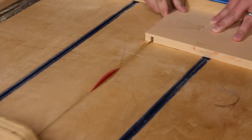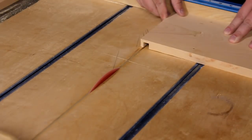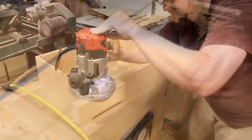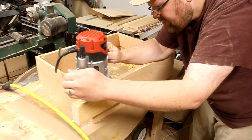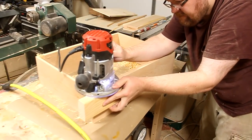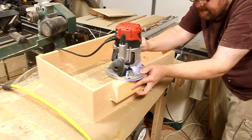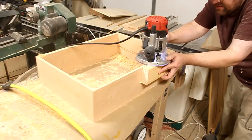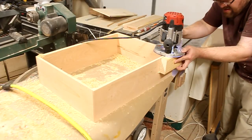Here I'm adding rabbets just using my crosscut sled. I should have done the rabbets about half of the board's thickness. I think I went about two thirds of the way up this time and it did cause me problems later on. I don't have a router table either so this is just my own homemade version. To add a little stability I hot glued a piece of 2x4 to it so I can hold on to the router from that angle and give a little more stability to the cut, and it worked great. I added that rabbet to all four sides of the box.